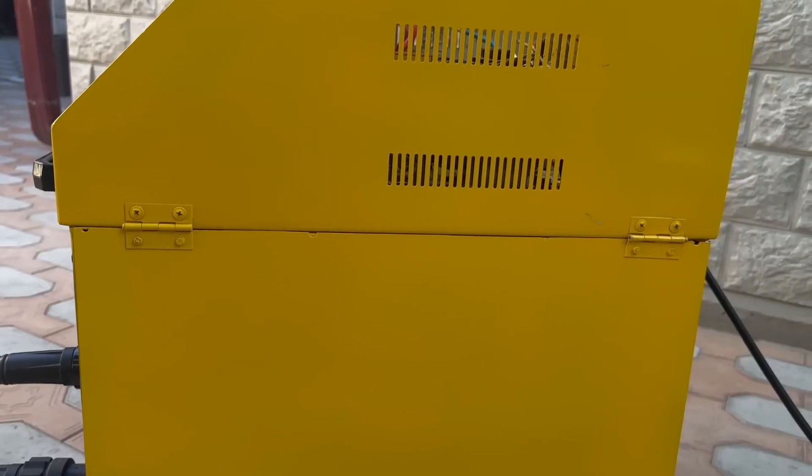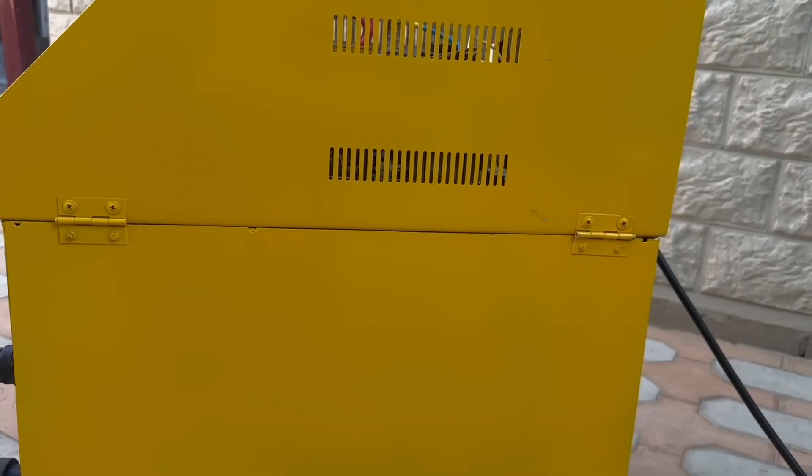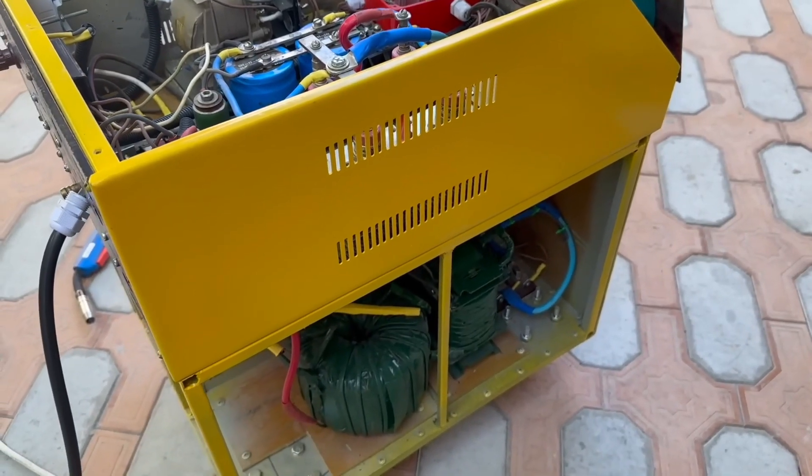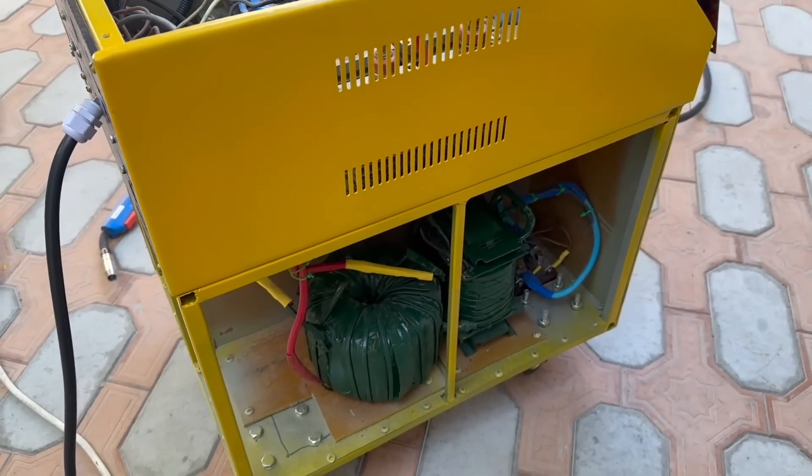In the other compartment there are power components in the form of a powerful toroidal transformer — also known as a power transformer — and a two-winding booster choke. It is this voltage booster unit that guarantees amazing ignition. In this part there is also a powerful 300-amp current shunt, which is a current sensor for the ammeter — it has no other functions. The ammeter and voltmeter show correct values, although instruments with a smaller scale range were needed. During operation the housing is closed on all sides. There are ventilation holes — believe me, this is enough. Although the device hasn't been tested in long-term operating mode, in theory there won't be any problems.